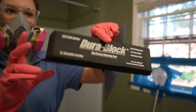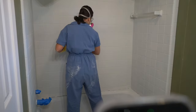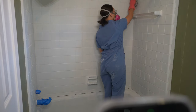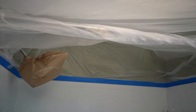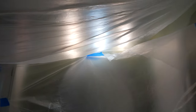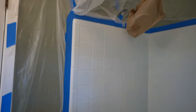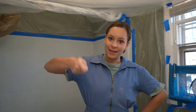We're going to spray paint the paint on, but now I have to super prep and tape everything off to manage the overspray. Remind me to never do this again if it peels. I did a very light sanding and removed all the dust with the tack cloth. I only had 500 grit — that was the finest I had — so I just lightly put some pressure on it. I went ahead and taped over absolutely everything.